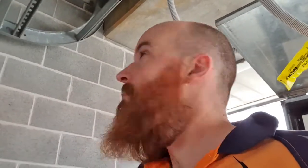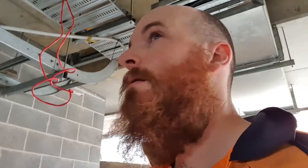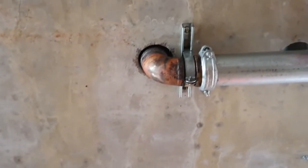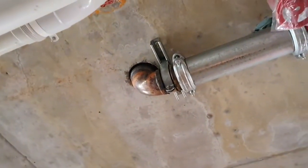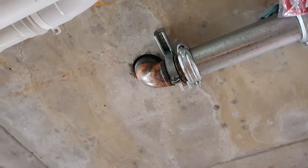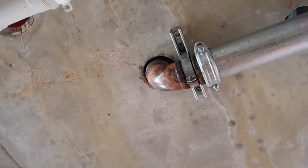One of these circuits had a pretty low insulation resistance. I saw it pop! That's where it popped — in there. They've obviously cut through the cable. Can you just reset the breaker and do it again? Reset the RCD and flick it on again — I'll see if I can get it on camera.